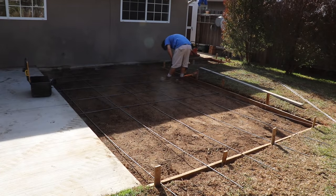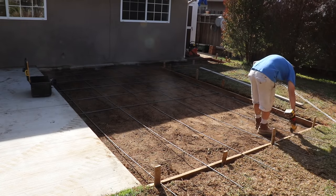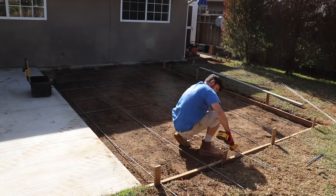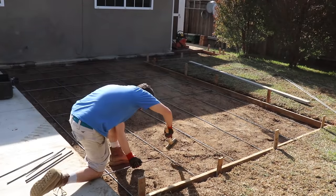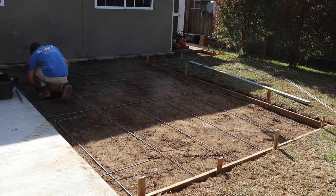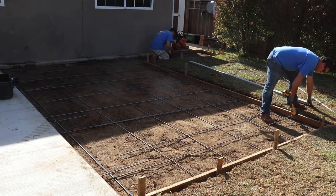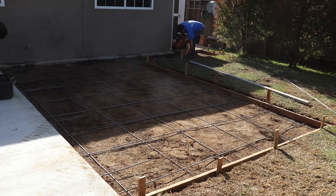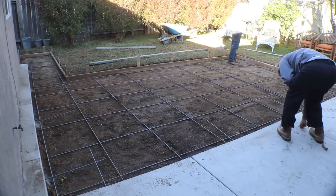The rebar will be laying at 2 foot centers, both directions. All those short pieces that are getting cut off right now, those will actually turn into the dowels when we pound them in. A lot of times when I tie rebar, what I'll do is I'll tie the perimeter 100%, and then inside the field, in the middle area, I'll go every other bar with a tie.